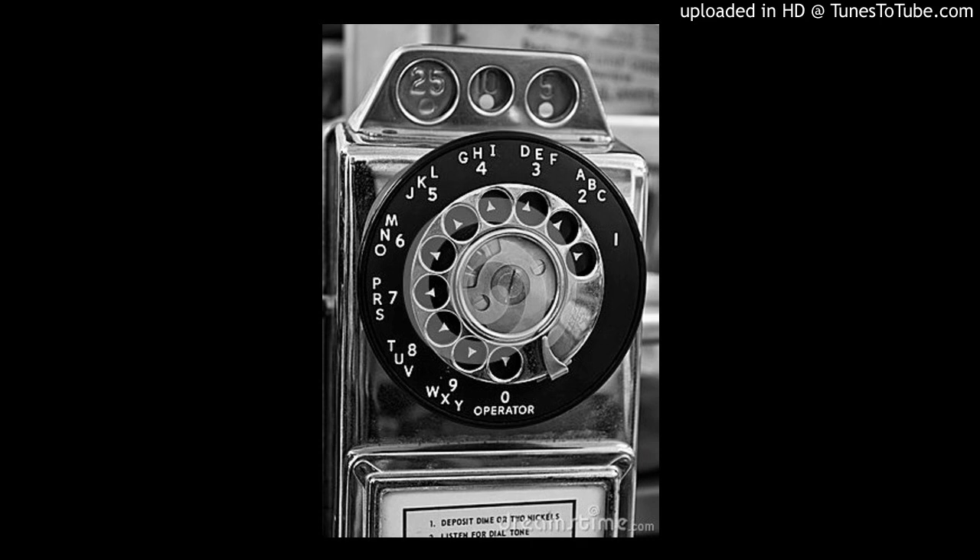One of the unanswered questions I have is from Montreal in 1974. It was my first trip to Canada, and I wasn't alone — I was kind of stuck with parents — so there wasn't time to discover all the nuances of the system. In one part of downtown Montreal, I found regular prepay, still using three-slot phones with mechanical gongs. But in another part of downtown and in Westmount, Bell Canada was using a coin control system that was completely unconventional for the Bell system. This was either a semi-dialtone first system or a crude dialtone first system — which it was depends upon whether you could actually use the dial to call short numbers like zero or 911 without putting a coin in, and I had so little time I didn't try it. It was implemented using the Northern Electric Centurion phones of the time — single slot, plastic front. Here's an example from a number one ESS in downtown Montreal. You'll notice that I pick up the phone and get a dial tone, indicating this is not a prepay coin phone. I'll put in a dime and dial the first six digits of a local call.